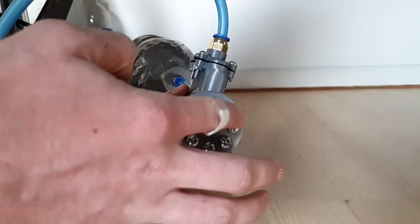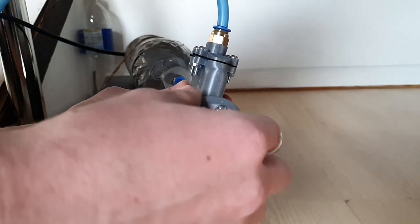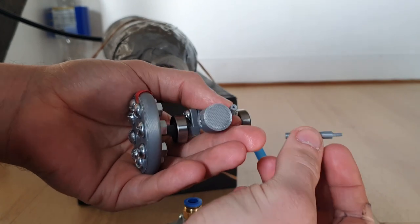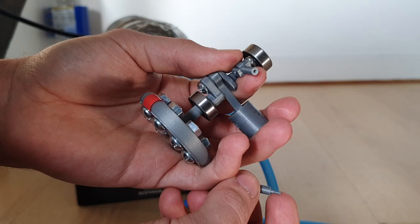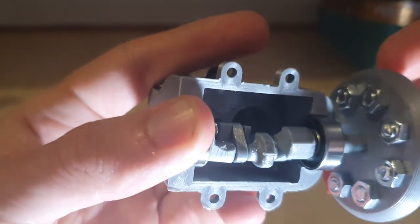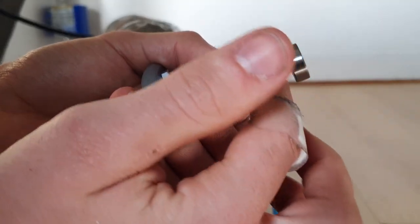And then suddenly this happened. So I pulled the engine apart and this is what I found. Now with all the things to snap, I did not think it would be that. I spoke earlier in the video about how I changed the rear crank and bearing design so that it was more rigid. What I didn't realise was that the push rod catches on the bearing connection part, and that the side-to-side and up-and-down motion that was there previously actually allowed the bearing connection to move out of the way of the push rod. By making this part stiff, I made it so that it could no longer move out of the way, and it jams and snaps the push rod.